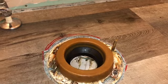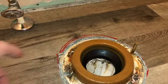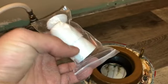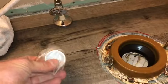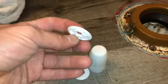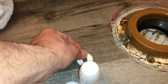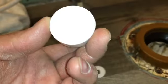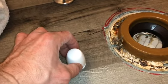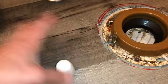Now that I've got the flange placed, I'm gonna take the new toilet, hover it over, and just place it on. Once I place it on, I'm gonna screw on the little nuts and then cap these. There's an order to these pieces — this one has a groove in it, so you put it on this way. Then the mounting piece snaps on once the screw is on, and it will lock in place into that groove. Even when cleaning it's not gonna knock off.